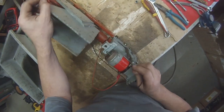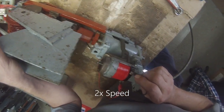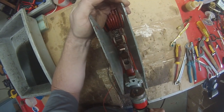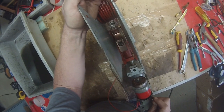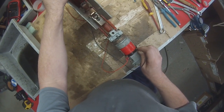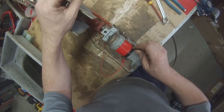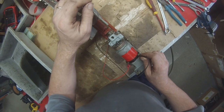Now what I like to do here is work it pretty well in just to get all that grease around there again. Have a close look at the action of the switch. Make sure the contact is closing square with the top. It's a nice positive action. And as you can hear, when it's on, there's no leaking except for the inlet here, which is leaking a little bit, and there's no leaking on the outside either, so that's good. Both on and off have solid actions and there's no air leaks.